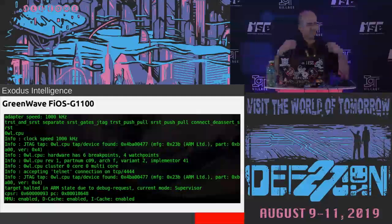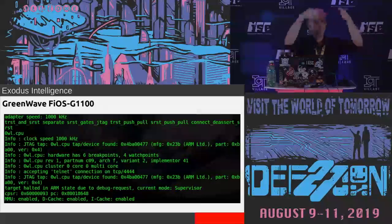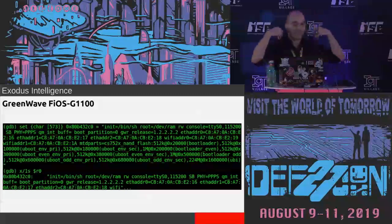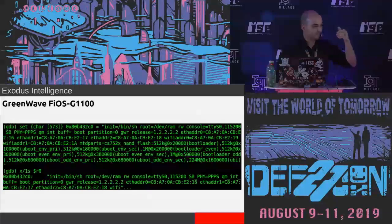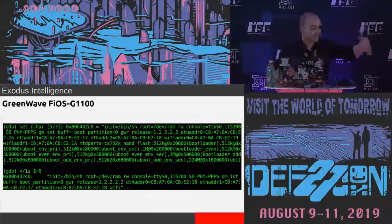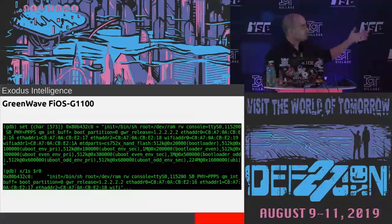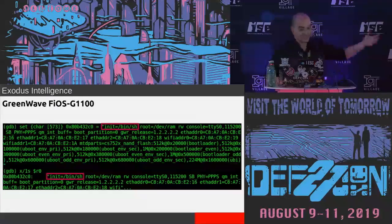I finally found it and I set a watchpoint to the very last character of that kernel boot argument, so that when it's done writing, the watchpoint will break, and I can override it. So instead of init calling slash init, instead of calling this upon initialization, because I don't have U-Boot access, like, yeah, I could ground the clock on the NAND or so, and make it fail, and maybe do a second retry and get into it, but again, I don't want to touch hardware. So I'm able to override the kernel boot parameters, set init to bin/sh. All right, awesome, and then we continue execution, and...